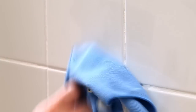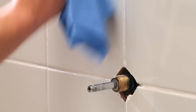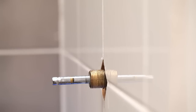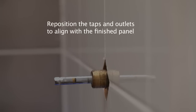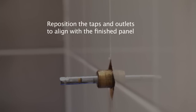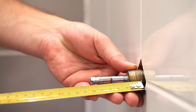If you're using Lustrolite in a renovation you must clean the renovation surface thoroughly. Make sure it's smooth and does not have any flaws, ridges or dips. The Lustrolite sheet is six millimeters thick and will add to the thickness of your wall. This needs to be accounted for when fitting taps, fixtures and shower fittings.